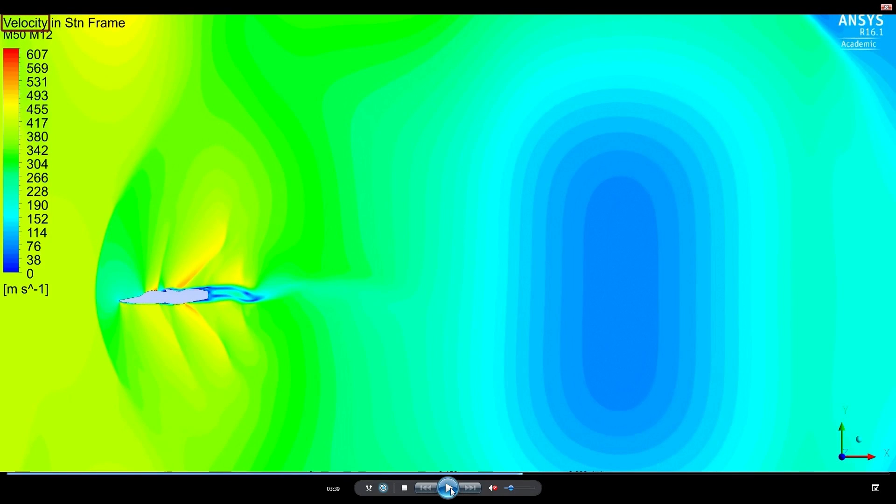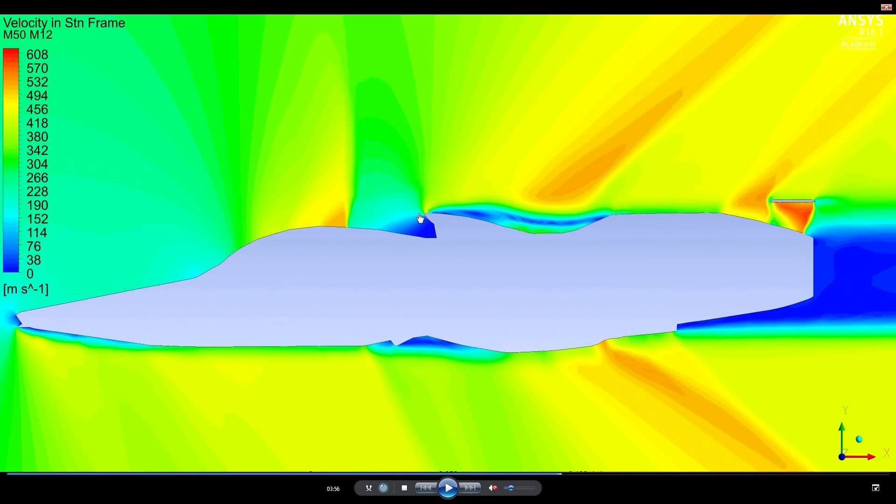What we're seeing here is a shock wave — three different shocks happening. You can tell there's a shock because of this defined color change from a hotter color to a cooler color, where the supersonic velocity immediately decelerates to a subsonic value in most cases. All the intakes here were turned off during this simulation.